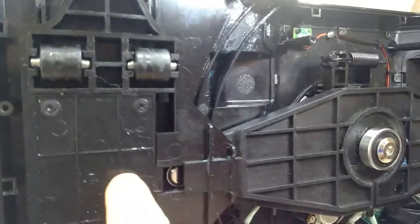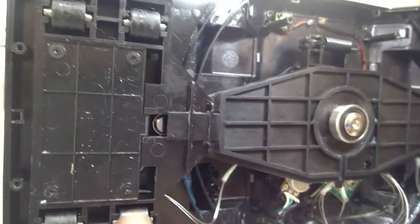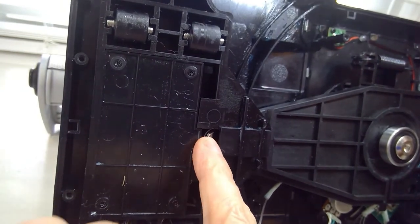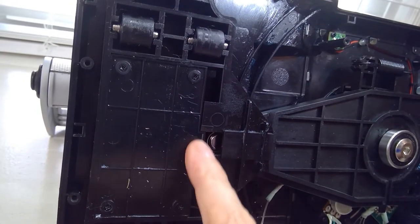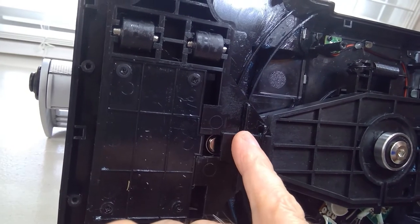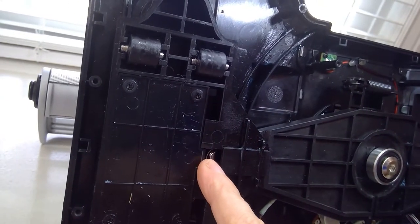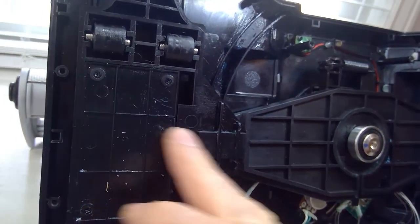What I did was I took 6 by 12 bearings - I'll put a link in for both bearings and the Chicago bolts and everything. And I used holster studs; they call them holster studs - the things they use to put together leather components. So I cut off the old plastic post that was on there, put the bearing in place - there was already a hole in the middle of it - ran the bolt through it, and it slides perfectly.